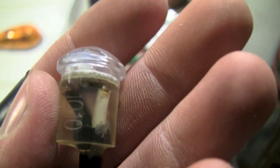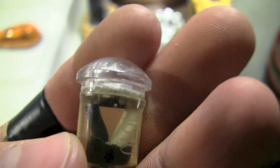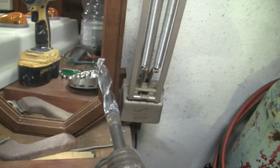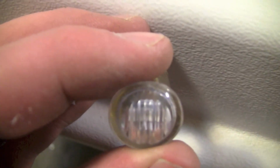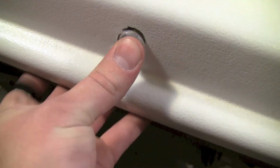Because I think with the grommet, you gotta drill like a 3/4 hole. I found this bit here, which is 5/8. And then you just take them, put wires first. And if you look closely, it actually says top on it. Make sure we get top side up. They go in a little harder.